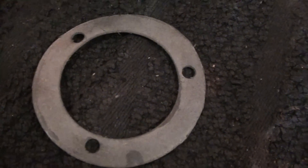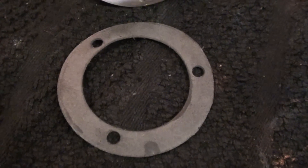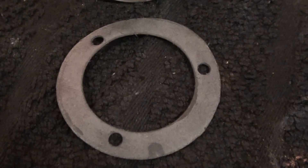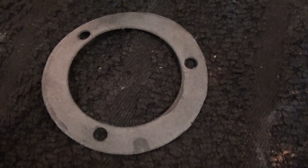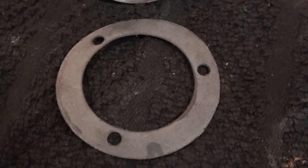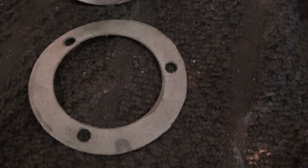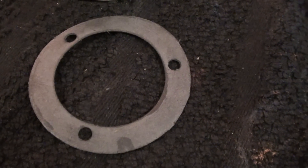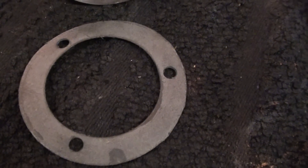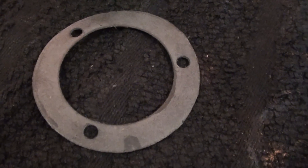That's the gasket I make for the cone. As the pump heats up from use, it's normal to get a little bit of pressure in the housing. You don't want the oil working its way past the seal or an O-ring. So a gasket is not going to be overcome by that. Just make sure everything is positively sealed, and there can be no error in sealing it either. As I've seen, most of the O-rings come out of these cones or pins torn in some way or another.